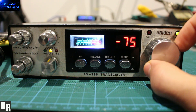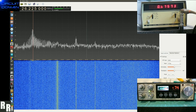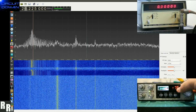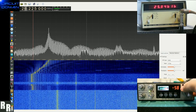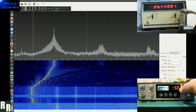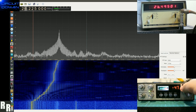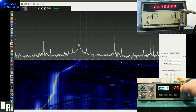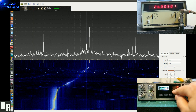Now I'm going to show you the actual demo of the 5KC working. I'll hit TX and we'll start from the very bottom and work our way all the way to the top and see what happens. Just watching that frequency counter — probably around channel minus 50 it'll start reading reasonable numbers. You can see the output is quite dirty down really low. Around about minus 52, it starts kicking in. You can see the 5KC stepping: 465, 470, 475, and on we go. You can see the dot when it's on zero, and the dot disappears when it's on the fives.